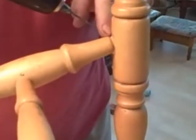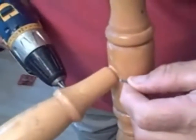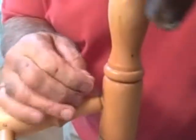What I'm going to do is drill on an angle that goes down through the spindle and into the main part of the wood. If I put the nail over here and go down through on an angle, it's not going to come out the front of the leg — but I have to be careful not to let the drill go through the front. We're going to make a pilot hole first because the drill wants to drift. I'll make just a little mark so the drill bit knows where to go without wandering.